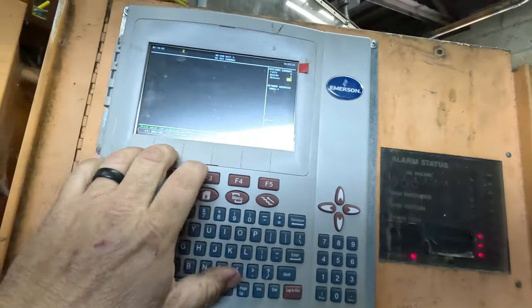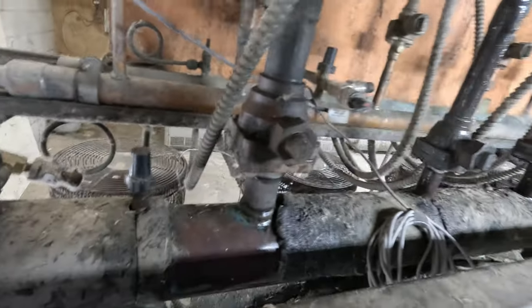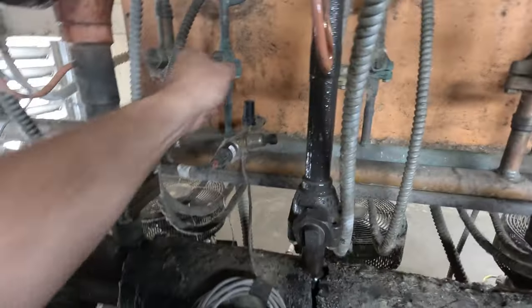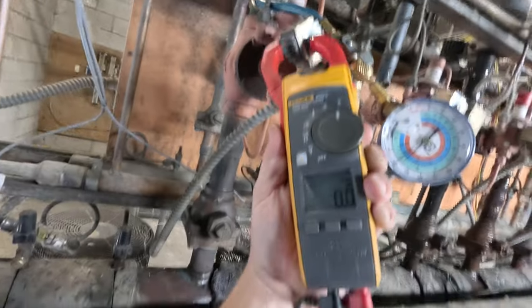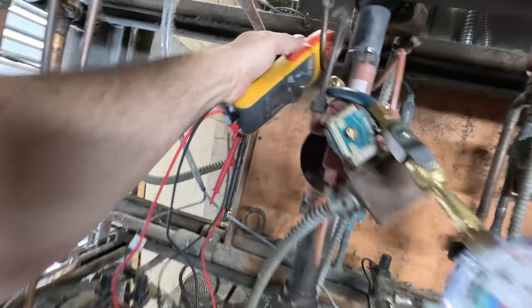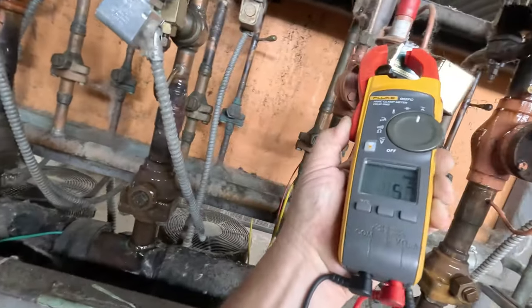I'm coming up to here. Let's see if this other one's doing it - yep, same thing. Let's go back into circuits, go down to six. It says drip - yeah, that's not blasting hot gas through there. Go ahead and shut it down. Go ahead and do the liquid, shut it down too. They've got little wrenches that'll fit in there. You can tell this thing's been worked on - all the caps are practically loose. We'll watch this and make sure it comes down. Our suction is really high yet, I haven't closed that valve yet. It should open up here shortly. Right now it is not open - you can see there's no magnetic field. With the clamp open, you have no magnetic field. Come up to the hot gas one - same thing, no magnetic field. Now if you come up beside one of these other ones, you can see there's a magnetic field there and you're pulling arbitrary numbers. So it tells you whether you've got a magnetic field or not - if it's dead, it'll be zero.